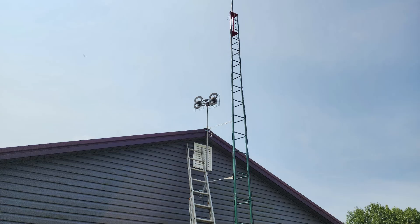All right folks, I just wanted to jump in here real quick on this snapshot. When you look at this tower right now, you can kind of see it's tied off at two points on the mast there for the TV. What Howard and his son-in-law were going to do this afternoon on this day that we raised the tower — they were going to be building three brackets, and that tower is going to have three points of contact with the house and the roof. That's one reason why the base isn't that big, and the house is going to be blocking a lot of the wind. There's going to be three points of contact, and then the base mostly holds it up and keeps it from shifting. We'll take you right back into the video.